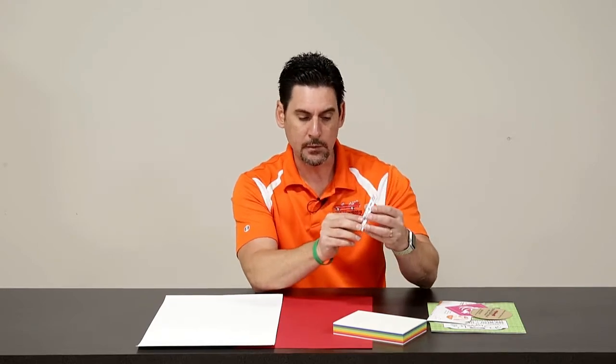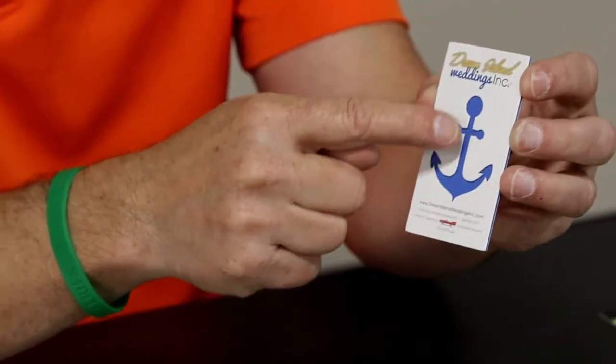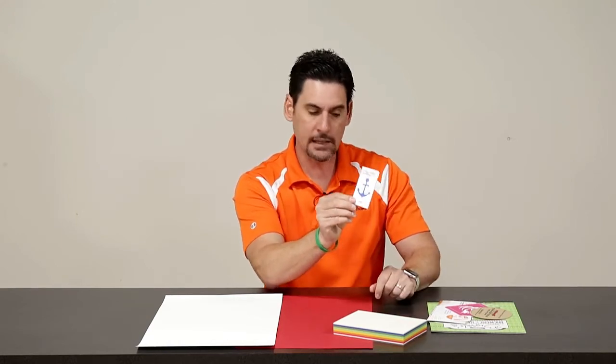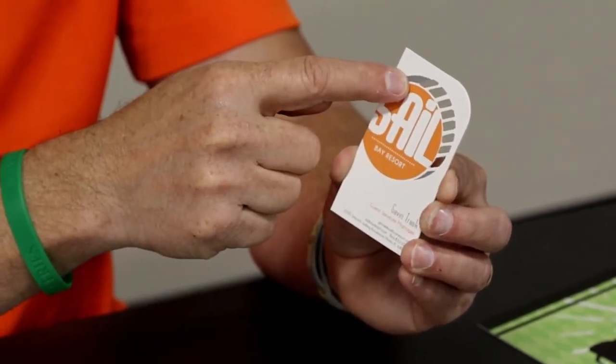This is a very interesting piece. The customer actually used 3 sheets of paper, but one sheet, glue one-sided, they die cut and anchor out. So when the sheets were put together, you can see the blue center core, which is glue two-side, actually comes through as an image on the die cut sheet. This is a one-sided die cut, or you can also have a through die cut where the sheets are put together, sealed, and the die cut is all the way through the card itself. This gives a three-dimensional effect.